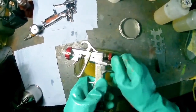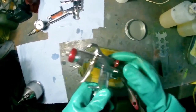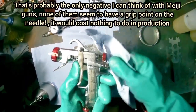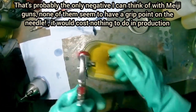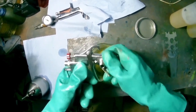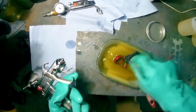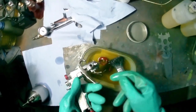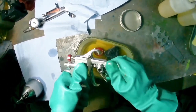Take the needle out from the back - put the cap in, put the spring in. This needle is always a pain to come out on these because they haven't got a shoulder on them, so pull it back as far as you can. There's nothing to grip on whereas a lot of modern ones do have something. Take the cap off and place it face down so the two air horns are in the fluid - that way anything caught in the air horn holes starts to be attacked by the thinners. Then we'll remove and unscrew the tip.